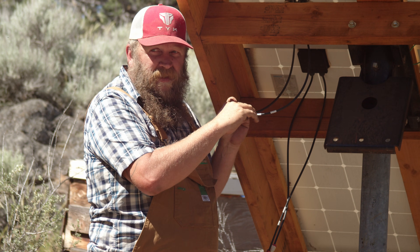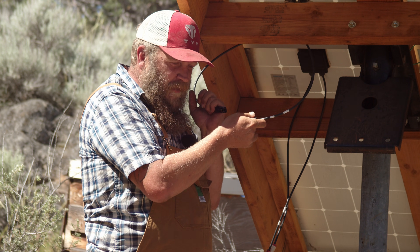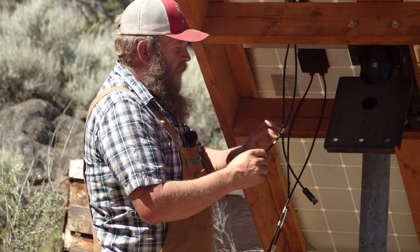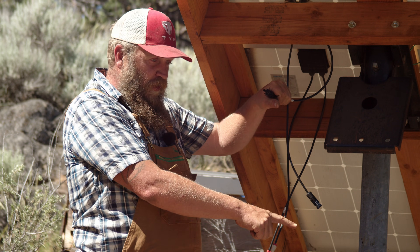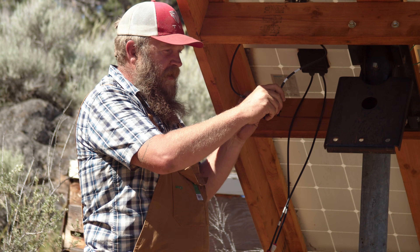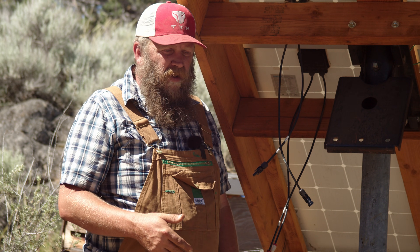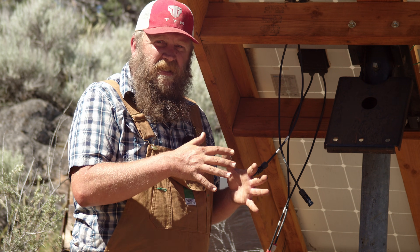Give it a pull test and you're good. Under no circumstances do you connect the two wires from the same panel together — it must be a plus from one panel to the minus of another. The MC4 connector is your friend. Once the series connection is made across all the panels, all you have to do is take the positive from one end panel and the negative from the other and make one connection to the wires going to your charge controller. Click, click, turn your charge controller on — and that's the entirety of this part of the wiring. I'll show you the rest in the next video.